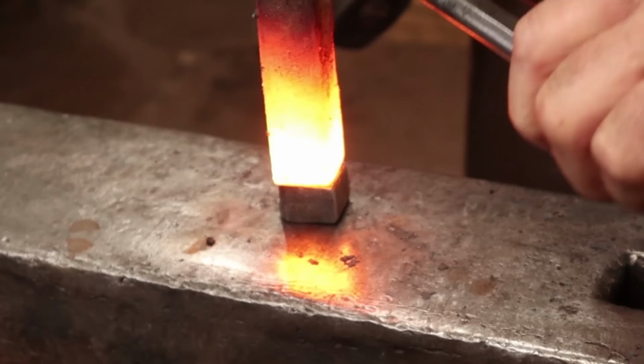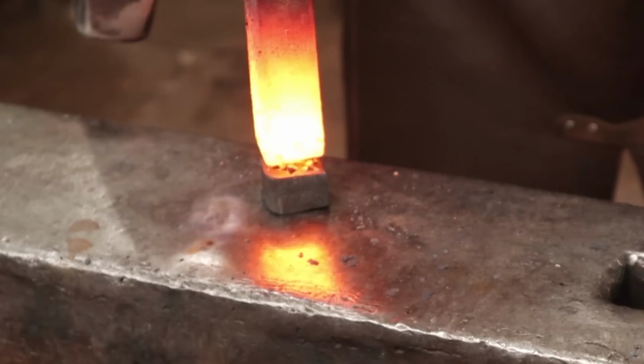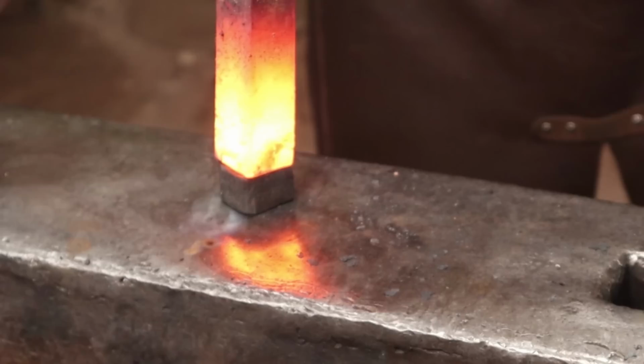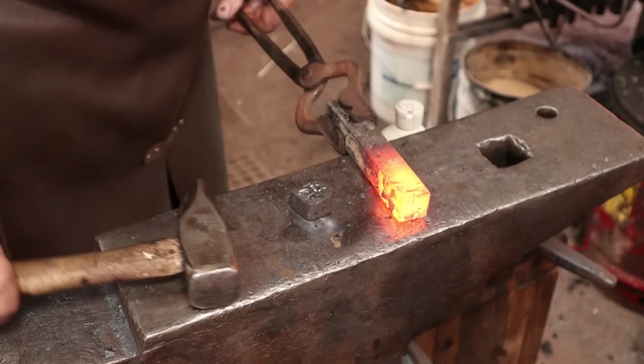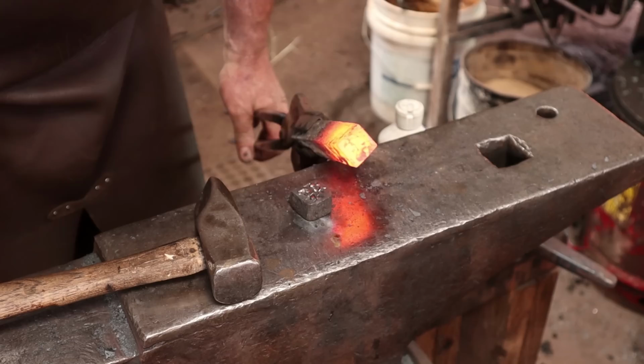No, not gonna stick. That's too bad. So what does that mean my options are? I either try to pull these out of the fire at welding heat and line them up, which might work, might not. Or I let myself have a little tiny tack weld from the MIG welder, and I think that's where I'm going to go, just to guarantee that we get this done today.